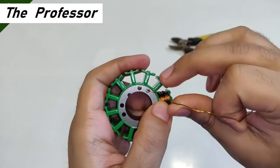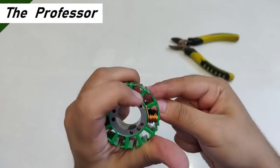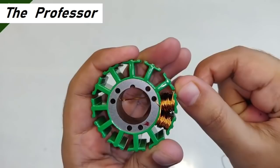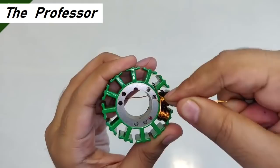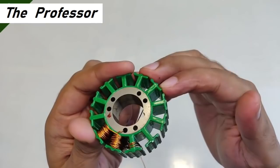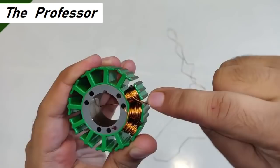I have to shift to the second pole — 25 turns on each pole. Initially we were going in the clockwise direction, but after completing two poles you have to go counterclockwise for the next two poles. The pattern is: two clockwise, two anti-clockwise, two clockwise, then again two anti-clockwise. This way we fill up the armature completely with copper coil.